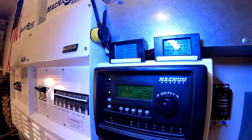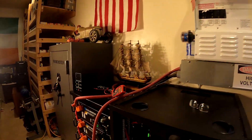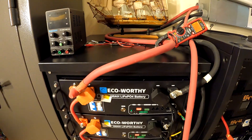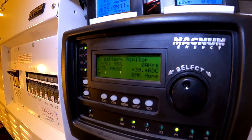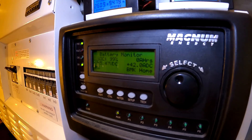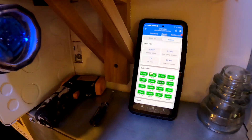I went ahead and put the car on here to try and drain the battery a little bit and massage it. So now we're pulling 82 amps out of the bank. You can see all of them are discharging now, so that's good. We'll bring it down a little bit and then try topping it again. I think I've got to reduce the amount of current — as this voltage goes higher, gets closer to 58V, I'm going to put more current to the car so it'll reduce the amount that can go to the battery. And of course we're working with the sun here too, so this is a little bit of a juggling act.